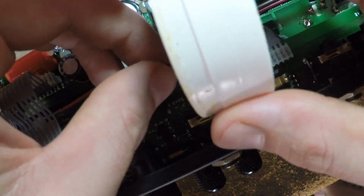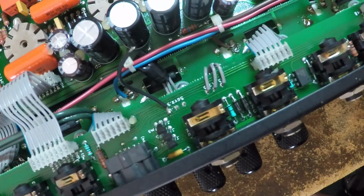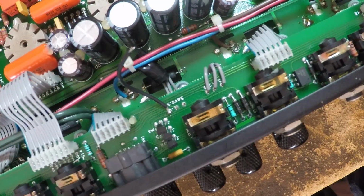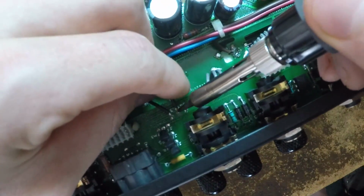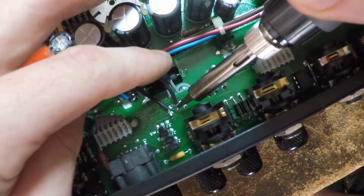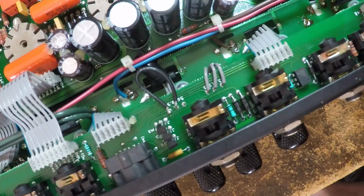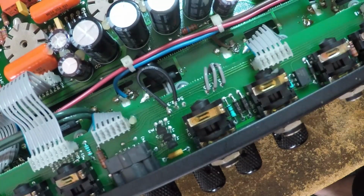However, I'm still a bit new with soldering iron myself, so I just made a little 2-inch wire and bent it in half and soldered each lead to each pin. Either way will work. I will also note that I was a bit shaky the morning I did this. Too much coffee. Anyways, be sure to tin the wire with a bit of solder before soldering to the board, and use flux as needed. This will help the solder stick to the wire and the wire stick to the board without too much hassle. Make sure the wire has a solid connection and tug it a bit to be sure it's not going anywhere.